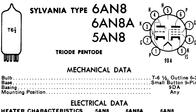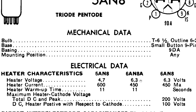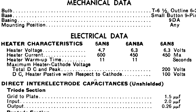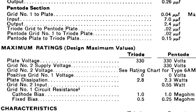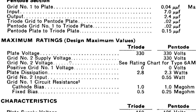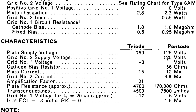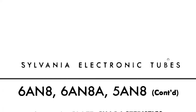Right here you can see that, again, the heater voltage on the filament is also very low — 6.3 volts. But the voltage on the plate is in the 300-volt range. So once again, this is high voltage, so you have to be very careful when you work with this.